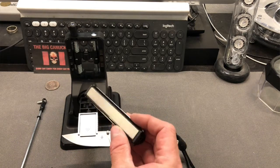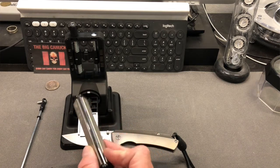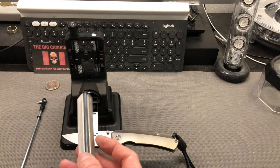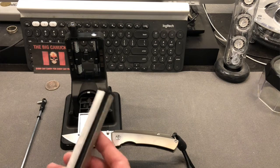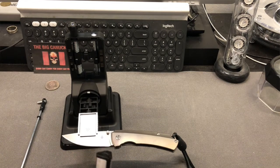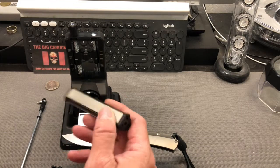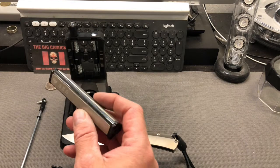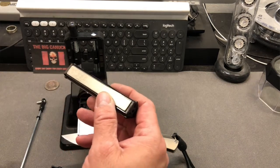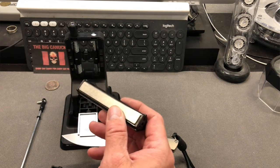So once you've used your heavy diamond grit and your ceramic, you could get perhaps a couple where you're lapping at, say, 30 micron, 15, 10, 5, down to 1 or even 0.25 micron, and putting some real wicked mirror polish edges on here. That's the one thing I think I'm probably going to end up doing: getting myself a couple of extra cartridges and using this to really, really strop, especially with these. I like stropping with these high micron lapping films.